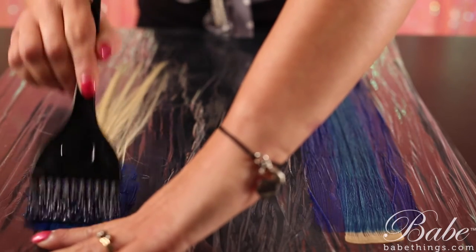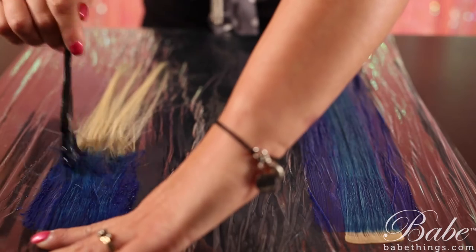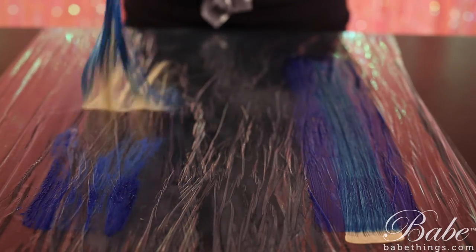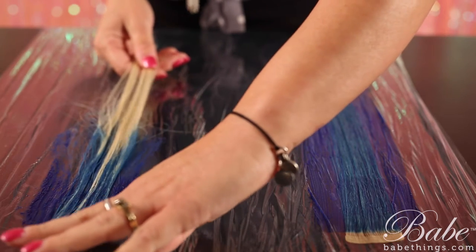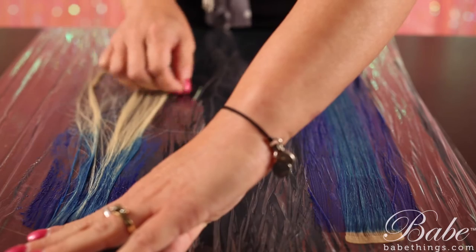Then paint your base color, your deeper color, up at the top. And then you're going to feather that — turn the brush on its side or on its edge and kind of feather that through down as far as you want, a little bit farther on the sides typically. Just kind of pull that through. And we also need to do that to the backside as well, so lift this up, flip that extension over, hold it up at the top, and spread that extension out just a little bit.